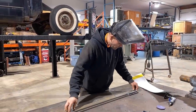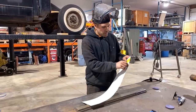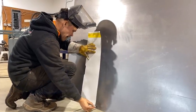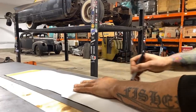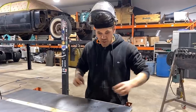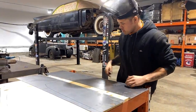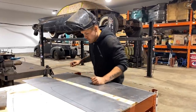That is the beginning of our hammer form. Now I'm going to make a couple of pieces of sheet metal. I'll add my three-quarter-inch lip on the top and bottom and take note of which way they're going to bend for left and right. I'm going to grab a sheet of 18-gauge steel and shear a little strip that's three-quarters of an inch so I can use it on the curved area to make dots all the way along so I know I've got a three-quarter-inch flange traced out evenly.